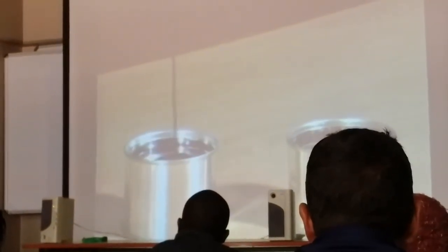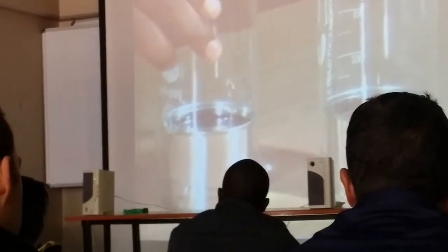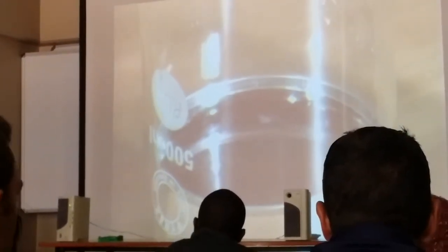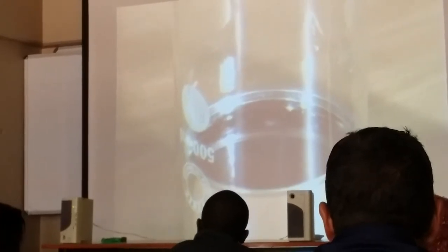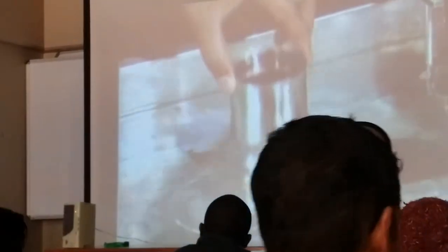Fill 2 specimen containers to a depth of at least 10 millimeters greater than the expected penetration. Cover the specimen container with a lipped beaker for 15 minutes to assist in the elimination of trapped air bubbles. Allow the specimen to cool at room temperature for an hour and a half. Place in the water bath at 25 degrees Celsius for the same period.